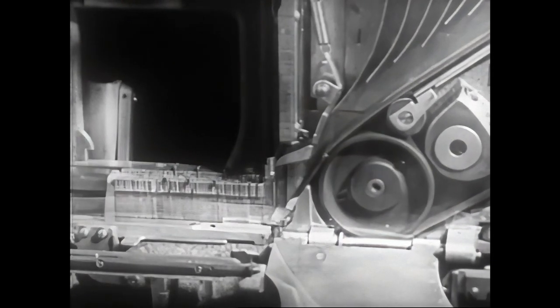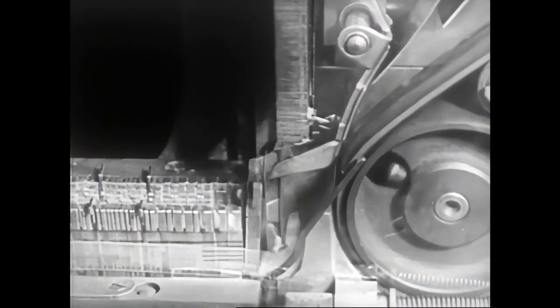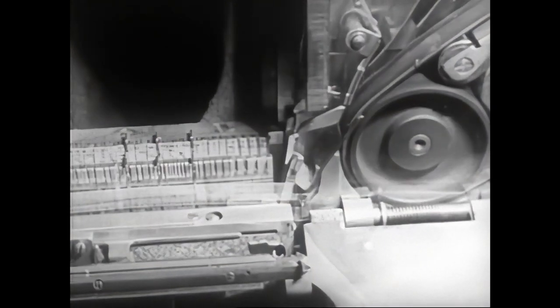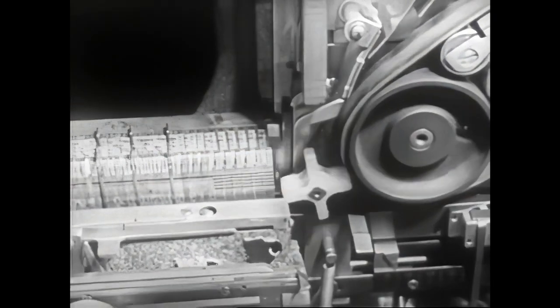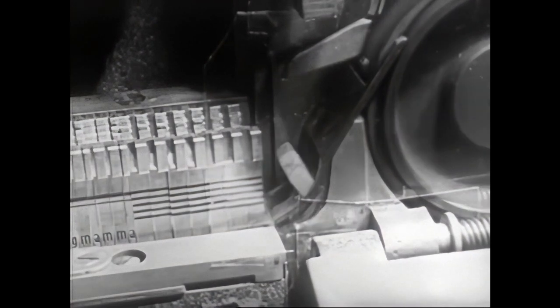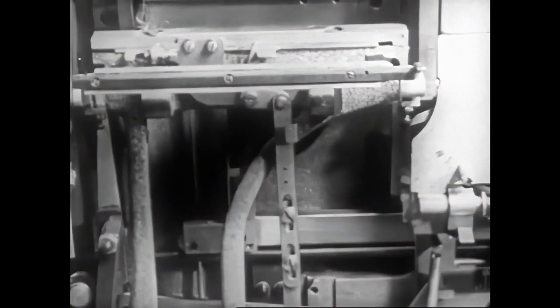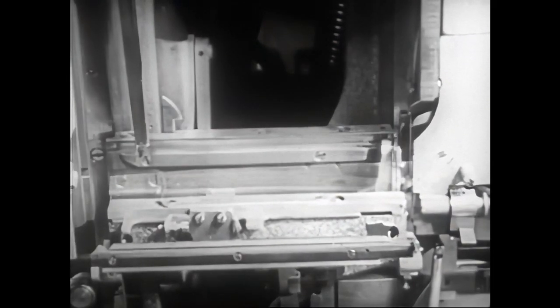Before reaching the assembling elevator, the mats have to pass under a small spring blade called a chute plate, which cuts down its speed so that the rotating star wheel can turn it upright and move it forward against the others in the assembling elevator. At the left, the mats are held upright by a wedge or a finger attached to a long horizontal bar called a slide, which travels to the left as fast as the mats arrive.